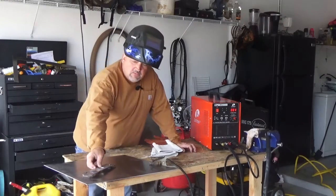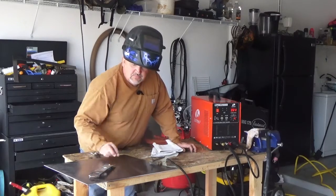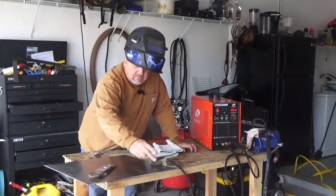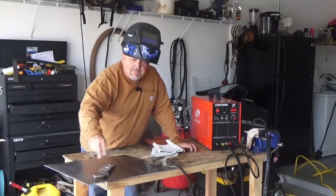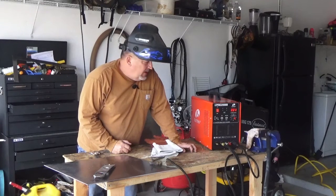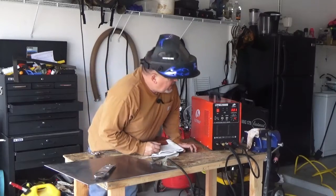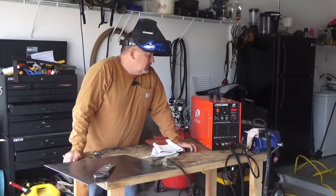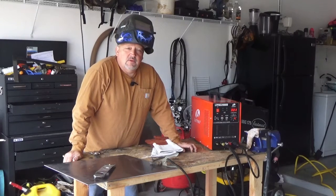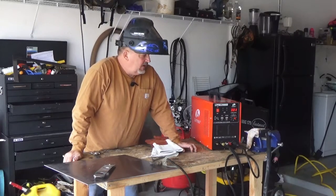We arranged our tool and cut the two guide holes — one for the 17.5 inch diameter and the other for the 8.5 inch diameter that's going to go inside of that. We've got the plasma cutter all set up. My amperage is set at 30, 31 — I don't think I need a lot. The compressor's been fixed; I had to change the pressure control switch. It works pretty well — it's set a bit higher than usual, but that's okay.